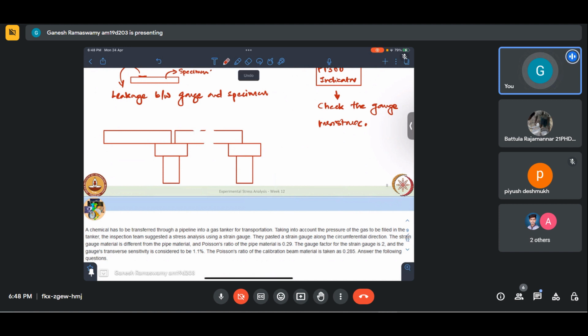So is bending the only problem in case of a bridge girder? No, shear also can affect. We know near the supports there is high shear. Let us say that this is a plate girder. From our basic theory of strength of material, our shear stress variation is parabolic. So at the neutral axis of this section, my shear stress is maximum and there is no normal stress. Now I can justify one way that bending stresses are almost 20 times that of shear stresses and I needn't bother about shear and go on scooping the material out.